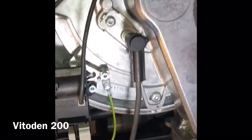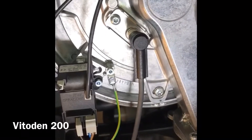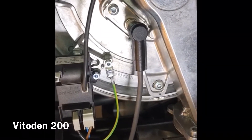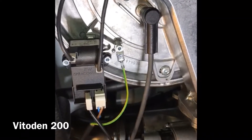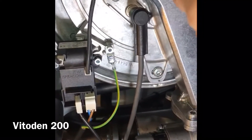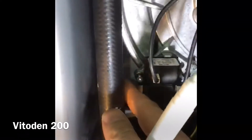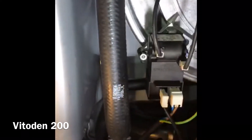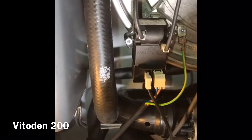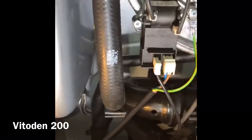With regards to the heat exchanger, always take it out every year and do an inspection. Clean it with vinegar or water from the condensation trap. You do not need to change the seals. You've got the hoses — give the hoses a feel. If it's crunchy, isolate it from the bottom of the appliance, remove all the debris into a container and reconnect it.